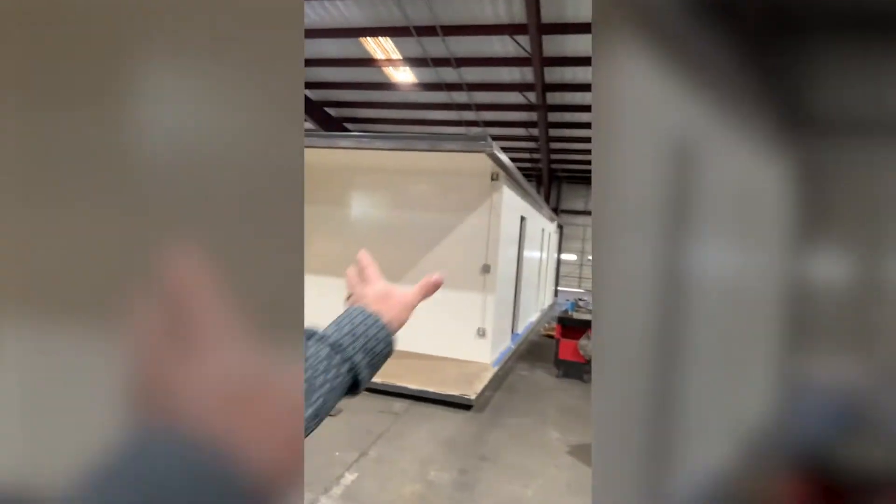This is what I would consider more of an upgraded style shelter. I'm going to walk out and kind of show you how we open them up. You can see how that flange works — one's going to slide up to there, these two are going to slide together, and then one slides here, so it's going to become one unit. All these shelters hook together — we bring them out in pods, then we weld them solid in the field. We have a coating we've had made: everything you see is not paint; it's a special epoxy made for ships that go into ship hulls on the outside and inside for the U.S. military. That's the product we use, with a couple of different additives.